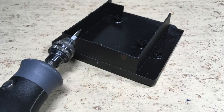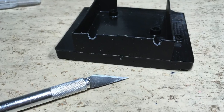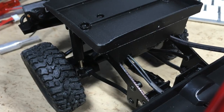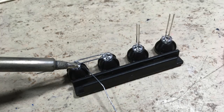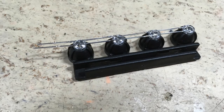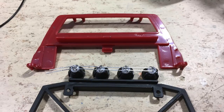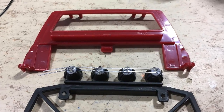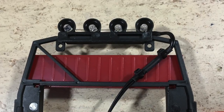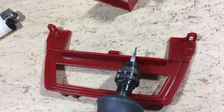To make some room for the wiring, we have to dremel two slots in the front cover. Here you can see why the slots are required. Of course we also want working rooftop lights — all four LEDs are wired in parallel. The next step is to solder the wires and to protect them with shrink tube. Again a slot is required to route the wires.